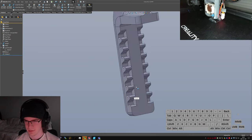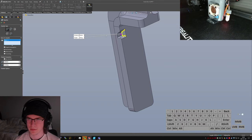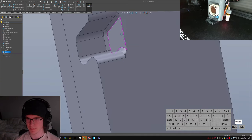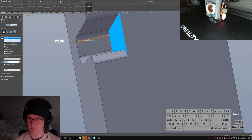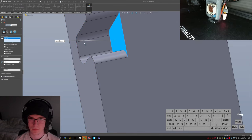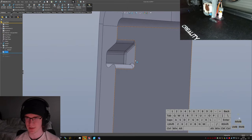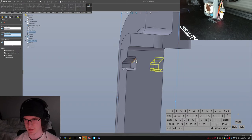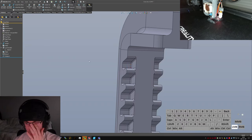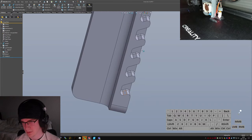Yeah, okay, fine. And I'm realizing now I should probably do a chamfer on the inside of this before. Well, no, it can get a fillet. It gets a full fillet on the inside there, since that's a sharp internal corner. But mirror and pattern are probably going to skip that because it's not selected yet for that. But since the linear pattern is patterning the mirror and the mirror already has a fillet, it should just go all the way down. And it does. Nice.